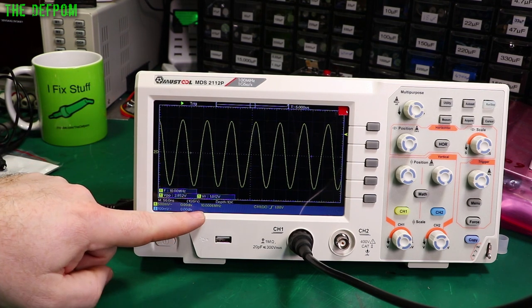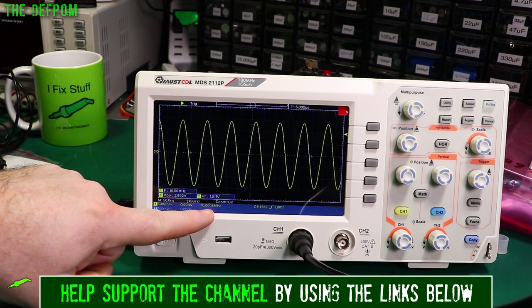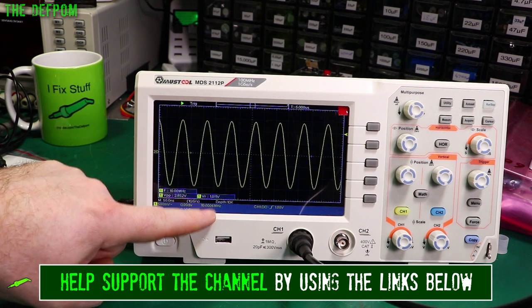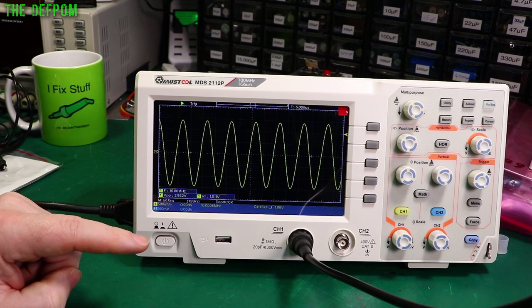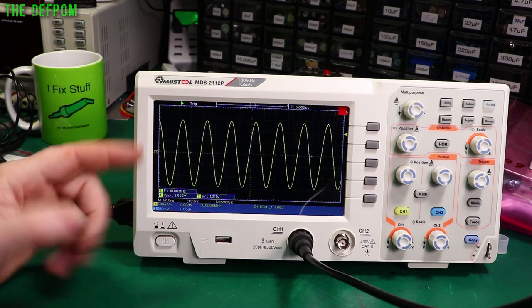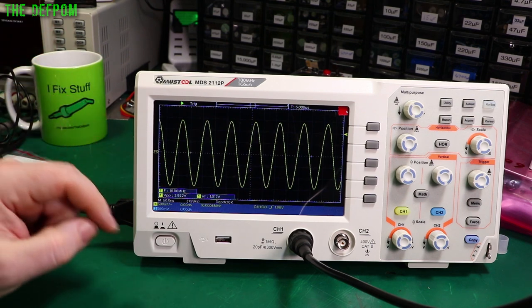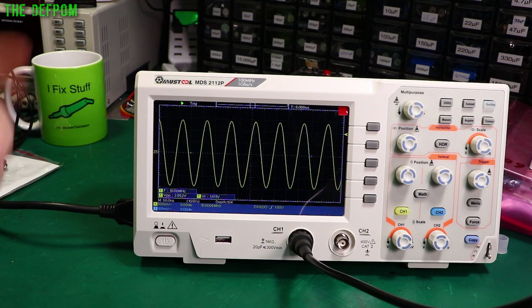One of the things I want to look at is that I'm currently feeding a pretty accurate 10MHz signal, and it's slightly off — only about six counts, but it's slightly off. I wonder if there's a way of improving that, maybe chuck a TCXO in it or something like that. We'll have a look and see if I can find the reference for this inside. It'd be nice to get this exactly right. It's not too critical, but this might be a good scope for my RF bench because it's quite a fast little scope.